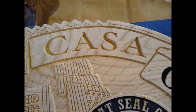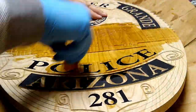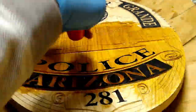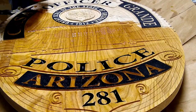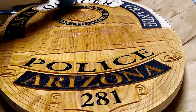For the areas of the banner that say Casa Grande and Arizona, I painted the background black — I didn't actually record that part but you'll see it in a second. And on to the finishing process. For finishing on this badge I'm using General Finishes Armor Seal — it's a wipe-on polyurethane. On the first coat I go very heavy for a couple reasons: it absorbs quite a bit that first coat, and I want to get it into a lot of nooks and crannies there to deepen the text. I want to saturate those areas really well.